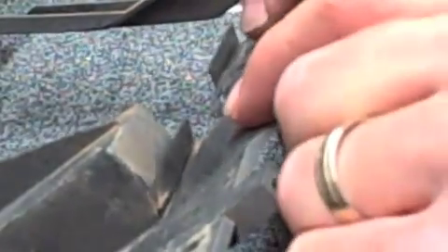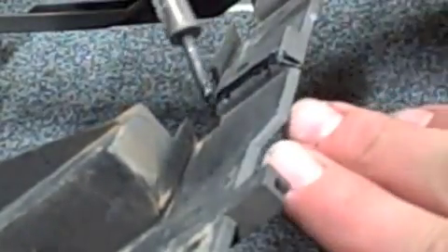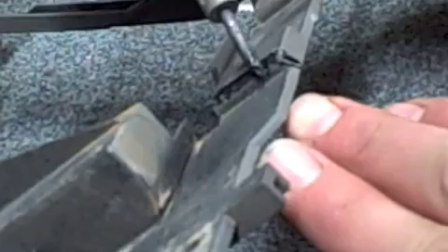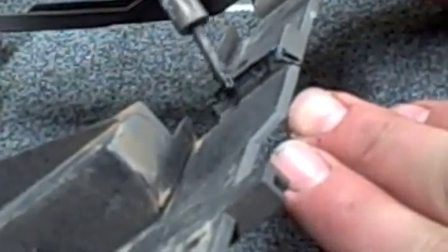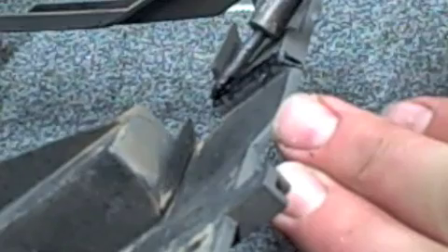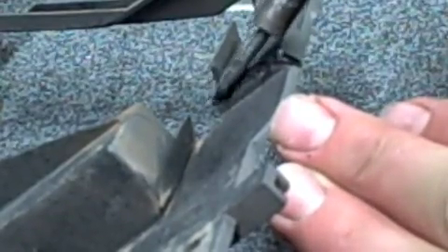Now we're going to create our channel. We'll switch the camera so you can see a little bit better. Create your channel in between the two broken pieces — as you can see, there is a nice big Grand Canyon look there. When you get done with that, take one side and fill it into that crevice, into that canyon area. Then take the other portion and fold it over the top and overlap it. If you do that, you'll have a really strong weld. We'll also take some of that epoxy we showed you at the beginning and go over the top with the actual plastic epoxy weld.